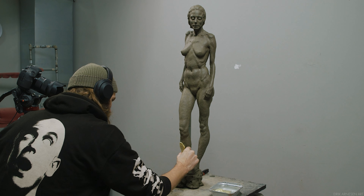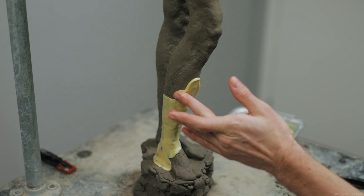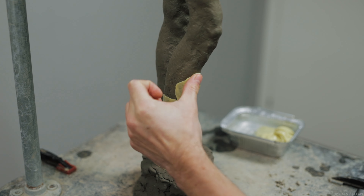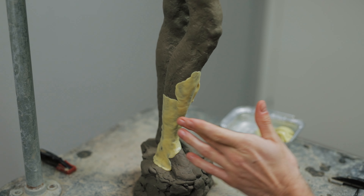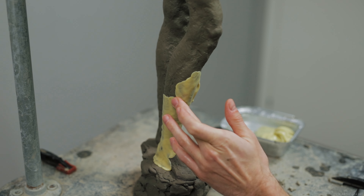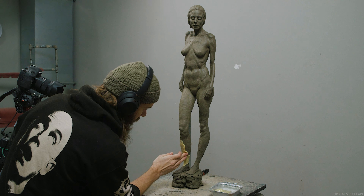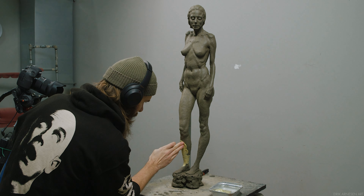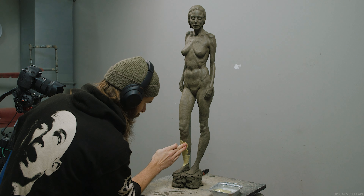To be clear, I don't wear gloves because I don't make that many molds and because I find the silicone sticks to them too much, making it too hard to work. That said, I will take my own tip and start using gloves in the future when I mix the silicone at least — I do believe that is very good practice to get into. Even when working with mixed silicone some catalyzer will still get on your hands, as it's not completely bound inside the mixed silicone, so be warned and play it safe.